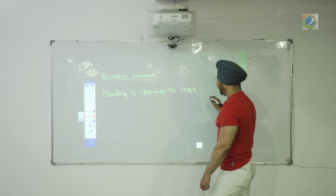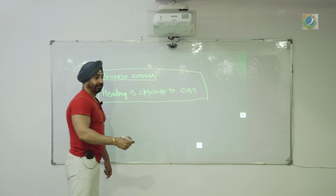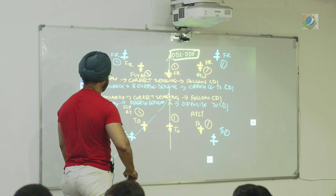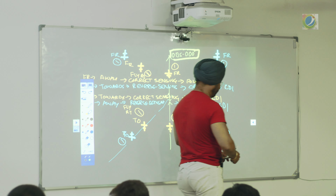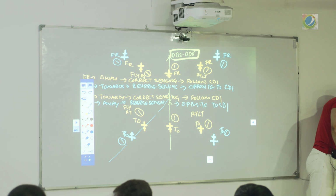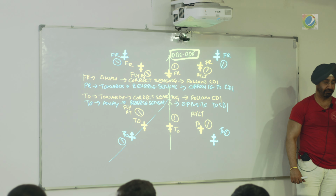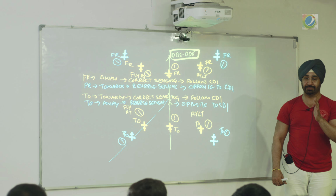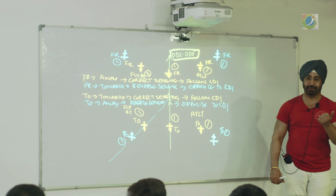So don't tell me after the exam, oh, the question was strange, it said OBS is opposite to heading. I am happy that everybody understood. It is clear on this indication and working of VOR. People find it very difficult. Like I said, the thing which you are using in the cockpit can never be difficult. It should be very conventional, very simple, easy to understand. So either these indications are based on TO or FROM, or whether it is correct sensing or reverse sensing.